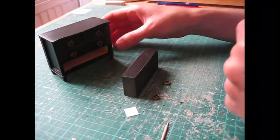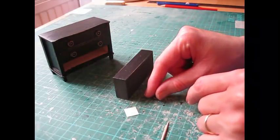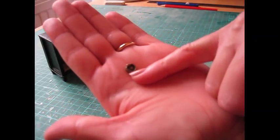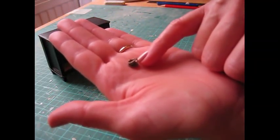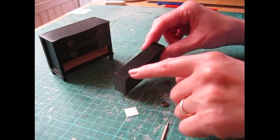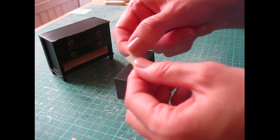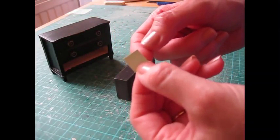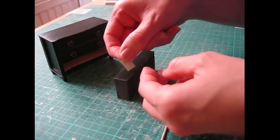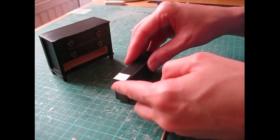So the varnish is now completely dried, and the final job is to add the drawer handles, or the drawer pulls. And I found this lovely sort of antique brass pull with this little sort of drop handle. And because it's difficult to make pencil marks on the dark wood, I've just cut a little piece of card here, which is 14mm square, or that's 9/16 of an inch, and I'm just going to use that to help me place the handles in the same position from each end of the drawer.